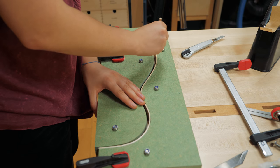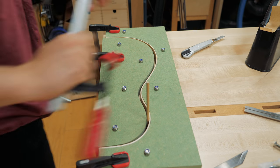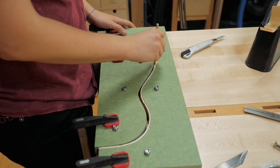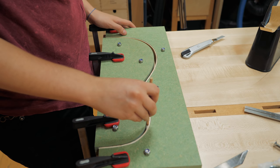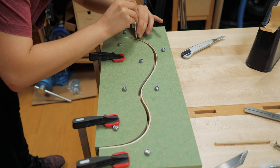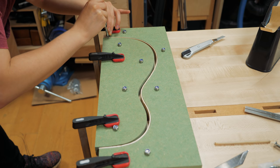Here I was trying to establish the correct offset of the inside part of the mold, so what I did was to fit a dowel with the diameter of the lining thickness on the two bouts area, and having the parts clamped to the workbench, I ran a compass along the perimeter to create the offset. I painted those lines with a Sharpie and sanded the remaining material.